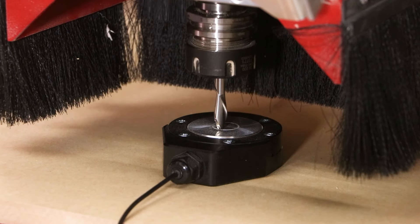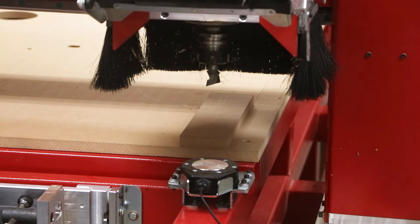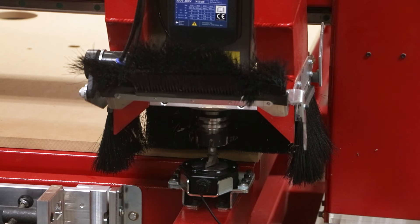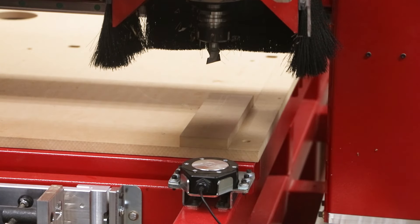I've got a question for you — I hear you say you really call it not manual tool change but semi-automatic tool change. What do you mean by that? Semi-automatic tool change is all based around the Legacy Smart Tool Pad. This is really cool because my code can be set up with multiple tools, just like an ATC code. When it comes down and asks me to change the tool, I'm going to swap the tool in and out with my two wrenches, tighten it back up, and just hit go. There's no measurement or anything else because the smart tool pad is going to do that for me, which allows me to keep on going with a really quick change.